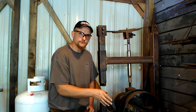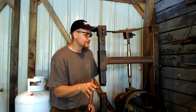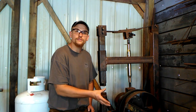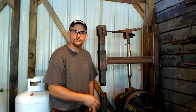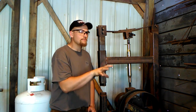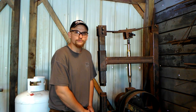There are no one-all-beat-all hammers. The holy grail right now is essentially self-contained power hammers because they seem to be the most versatile, but there are mechanical hammers just as versatile with just as much control. I particularly favor the Helve-type hammers for the control they offer, as opposed to the Little Giant style. The original Little Giant power hammers were designed to beat out plowshares — that's why they had one small die on top and a bigger die on bottom, meant to draw out and re-sharpen points on plowshares. That was their original design purpose, and it did it very well. That's why when you see guys trying to run two-inch stock under a 25-pound Little Giant, it's not going very well — it wasn't designed for it.